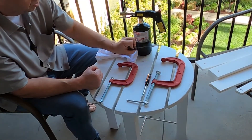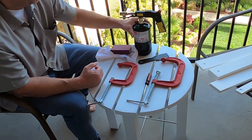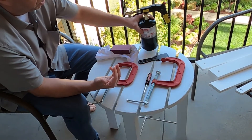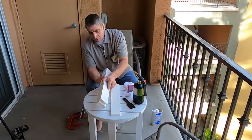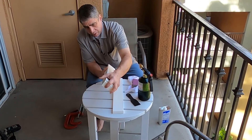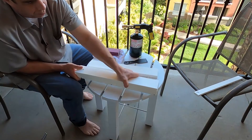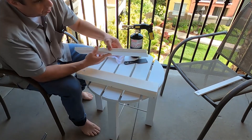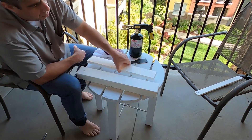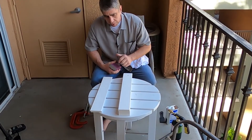I'm going to use this putty knife. I've got my screwdriver to pry open my container of acetone, and I have my propane torch to prep the surface. I have two sets that I'm going to glue together, so I'm going to inspect them because this product has imperfections. I'm going to look for bows, just like you might for a piece of lumber, checking to see which two surfaces are going to mate best. Once I have that established and everything oriented, I'll start sanding.